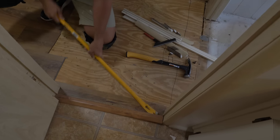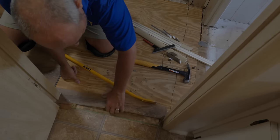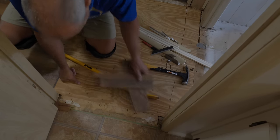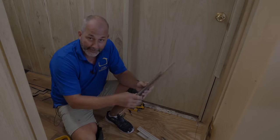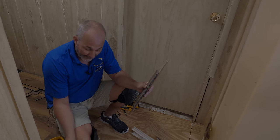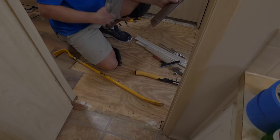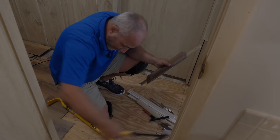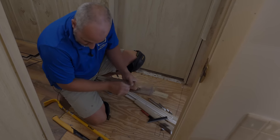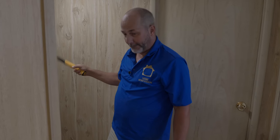I'm curious whether they ran plywood in here too. That's particle board again — or actually, no, they did change the plywood in the bathroom too. That's really interesting. If the whole bathroom has been changed out we'll find out later, and I'd stop the subfloor here and transition into the bathroom — no need to put new plywood on top of new plywood. Eight feet away they didn't change it out and bad spots opened up causing damage, so they weren't thinking about the whole job.